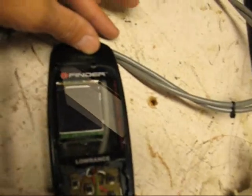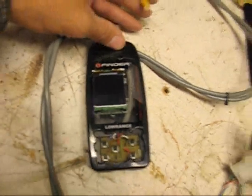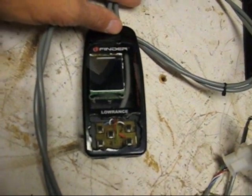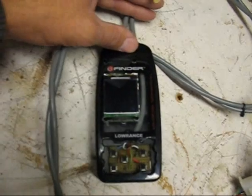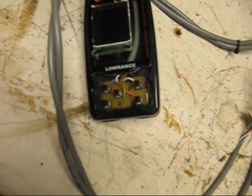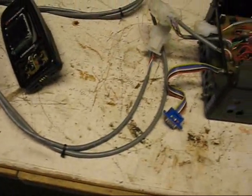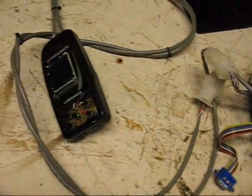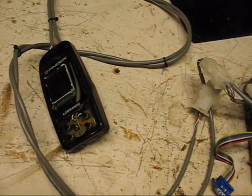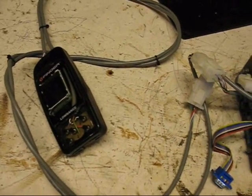For the display, I've got a color LCD — basically the Nokia knockoff from SparkFun.com. It's housed in an old Lowrance GPS unit I found laying around. I gutted it, made it all fit, and zip-tied it together. It's got five push buttons mounted on a chunk of perfboard, soldered together. It has two cables coming out the back: one for control, buttons, and power; the other goes directly to the LCD — serial control, serial data, serial clock, reset, chip select, all those lines.